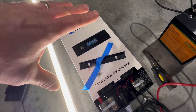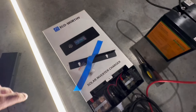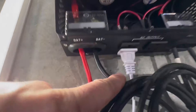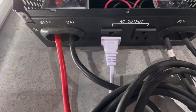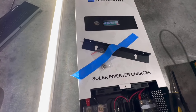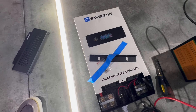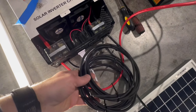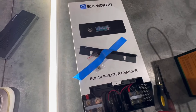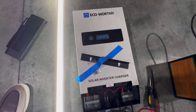We've got about $450 to $500 in electronics here. We will mount this on the wall in a box in the container with the batteries. It has regular 120V outlets on it, so we'll run those into a junction box and then run conduit in the container — two, three, or four outlets, a light switch, and the light. Then we'll put the panel on top of the container. You can bring the solar panel wires in using waterproof glands bolted onto the container, or go through one of the plastic vents to avoid drilling extra holes.